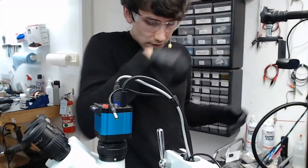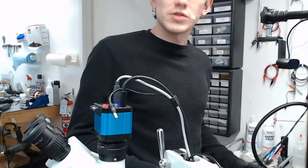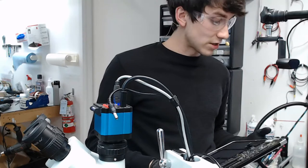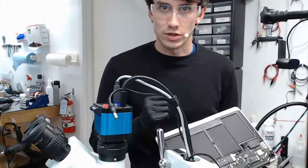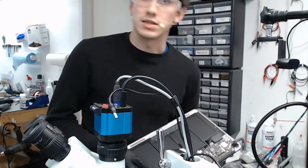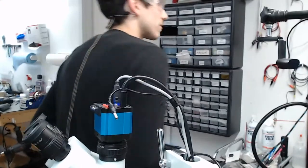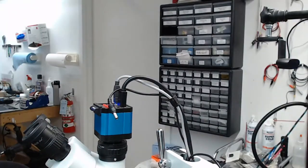All right, for those that are joining us, I'm doing something that I've never done on stream before. There's two stripped screws from a local franchise repair shop, so we're gonna have to actually cut a line through our screws with a Dremel so we can use a flathead screwdriver to remove the screws so that we can actually continue with the board repair. So it's gonna get loud for a second. Gotta have a steady hand.